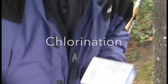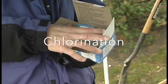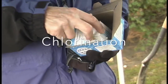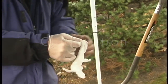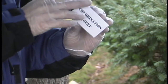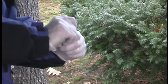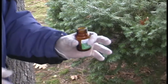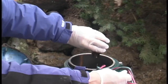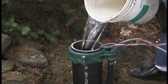What we're going to do now is we're going to perform a well chlorination. This is an ETR chlorination kit — inside are all instructions. You have your chlorination powder and alongside is a water test kit also that goes with the kit. You want to use the gloves that came with it. The material is calcium hypochlorite, and it could burn you if it stayed on your skin any length of time. It's a very simple process — we just open the bottle, it's a glass bottle, there's a sealing cap on it. Just pour the powder right down inside the center of the casing. Very easy. Once that's done, you want to take a little water and just flush it down.